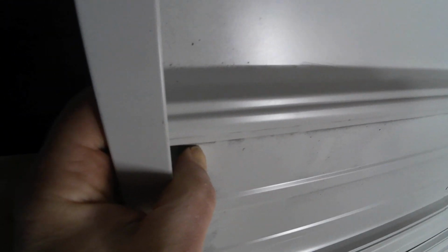If this isn't really that straight, you won't have a gap. So see how that works. Then you won't be able to tell that from the ground, all that little overlap. And then the top piece, you just slide it just like that. It slides underneath the wood, and then you'll nail up underneath, screw up to that wood to hold this panel or this J channel in.